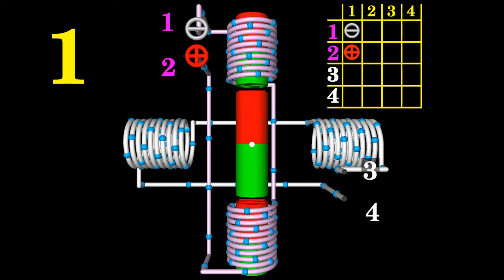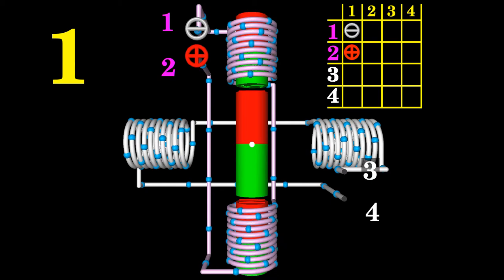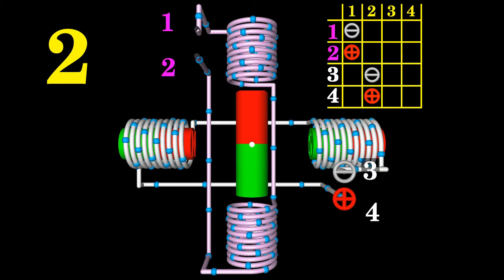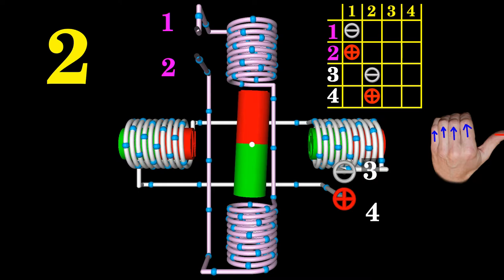To make the rotor spin clockwise by another 90 degrees, the horizontally aligned electromagnets have to be energized with a polarity that creates a magnetic field whose north pole points to the right. As soon as the horizontally aligned coils are connected to the voltage source, the vertically aligned coils are disconnected from the electric power. The cathode is connected to terminal number 3 of the motor, the anode to terminal number 4, which is the lower end of the wire. The thumb of your left hand points indeed to the right when wrapping your hand around the coil with your fingers pointing into the direction of electron movement.